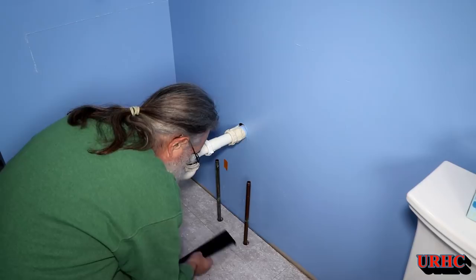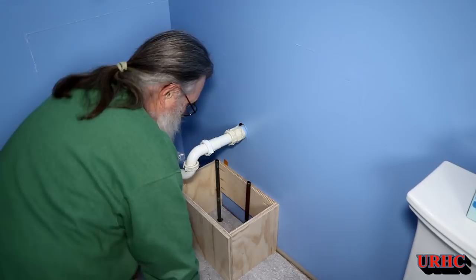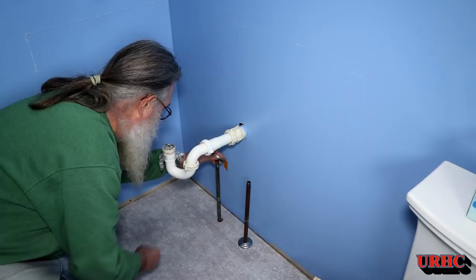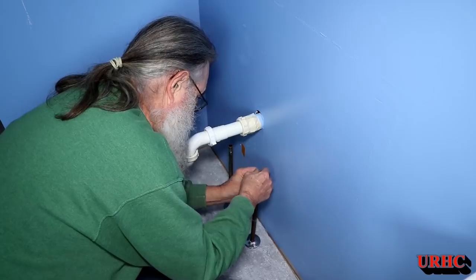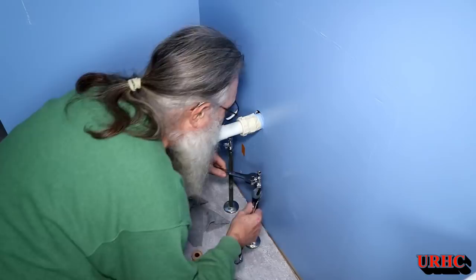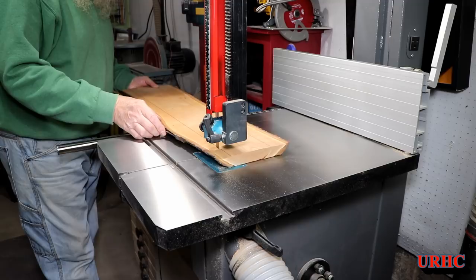The flooring is now all done in the room — we really love this flooring, it's nice and stays clean, though it's a little echoey sounding. The pedestal fits in there, and everything is going to go together. I'm sliding the compression-type valves on now — I'm using these because I have to actually remove them later to put the cabinet in. I used a pipe cleaner wire brush to clean the pipe off for a nice smooth surface for the compression ring to seal on, then slid the nut, ring, and valve in place and tightened it up.